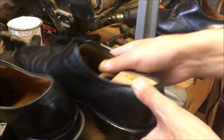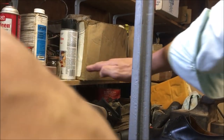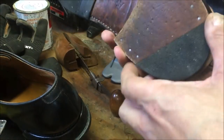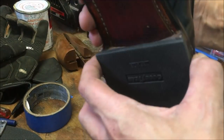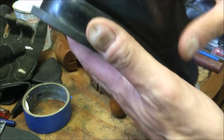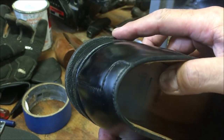And the way you do that is you put the rubber and the leather on the belt sander and use this flat part to grind it completely flat so that the two edges mate up with each other, okay? So, there's more to this than you thought there was, isn't there? So now I've got that, and since this is pretty close, okay, I can sand that down, right?